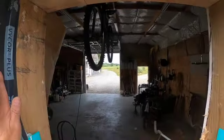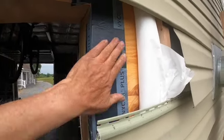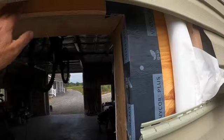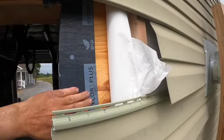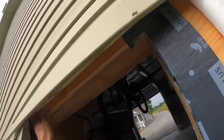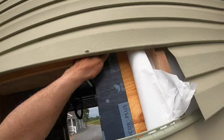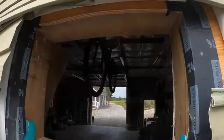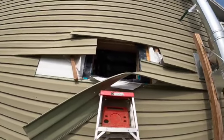I've got the sealant tape — the waterproof tape — in here now. So I'm going to put the window in, then put a piece of tape across that so anything that rolls down will roll down and away. I'll put the tape up under here, put the window in, get it set in place, then put a piece of tape across the outside and down on the other side as well. That'll make sure I don't have any water seepage. That should do it.